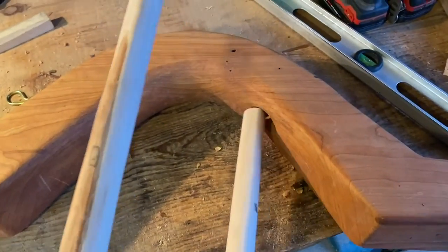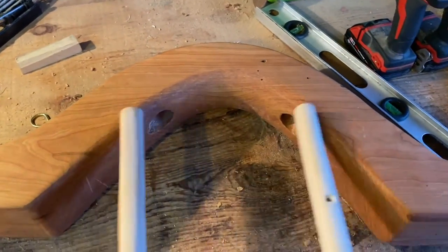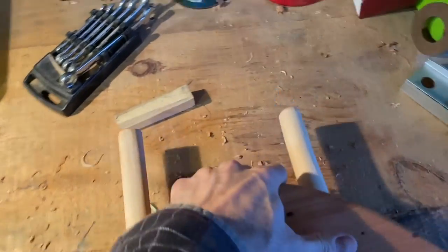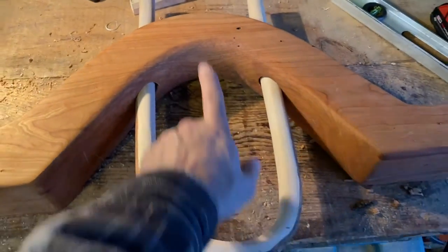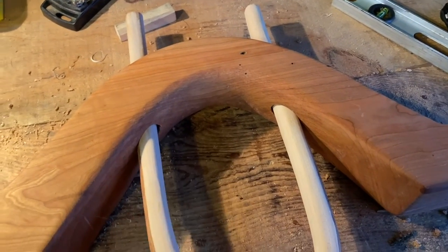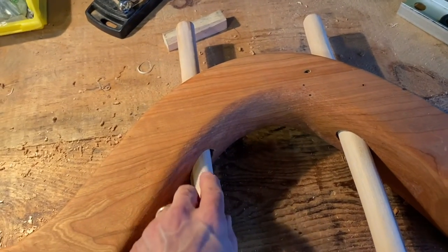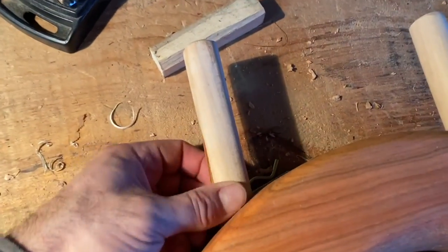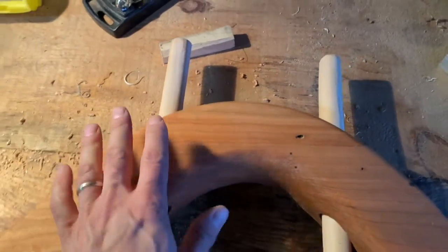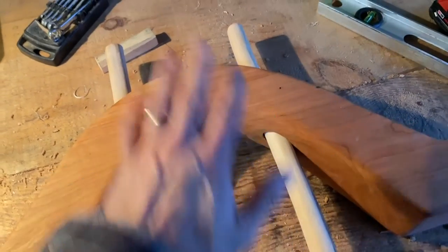This is a 6-inch single yoke — dimension when I started, 6 inches between, and I want to keep an eye on that. As I shape it and round it out, I'm going to stick it into the yoke holes and make sure it's nice and smooth, and then both should fit and go up as high as I need it into the yoke. This really takes some of the most time — finishing the bow just to make it round and fit. You'll push it in, pull it out, it'll get bound up, and you'll see where the yoke actually marks against the bow, and then you'll have to take a little material out where it's too wide. It just takes time, taking a little bit of material off at a time.